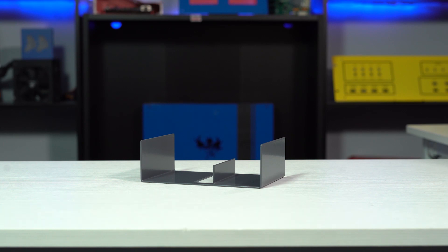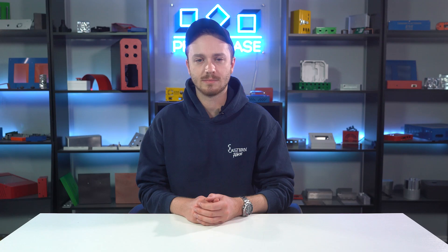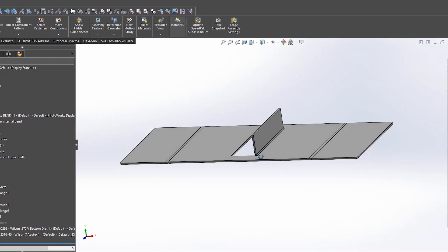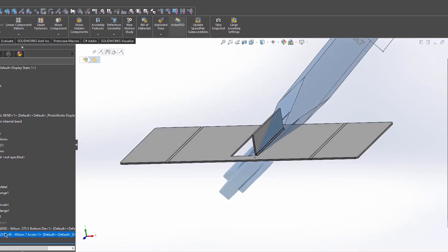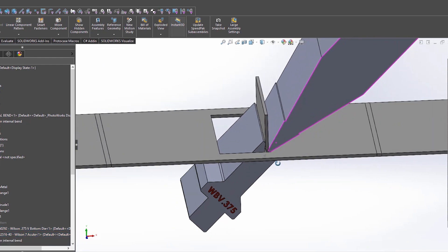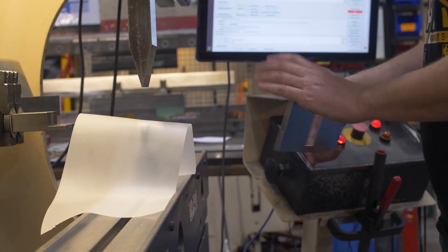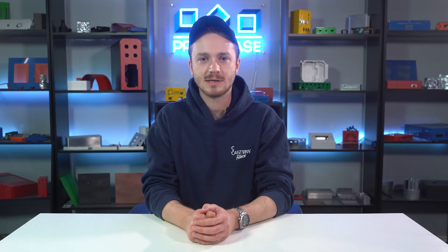Up next, internal bends. An internal bend is a bend that is placed on a particular area of a part where material surrounds the bend, rather than a conventional bend that is placed at the outermost edge of a part. An inset bend is very similar to an internal bend, except an inset bend is inset a small amount from the edge of a part, instead of being completely inside of the profile. In order to create an internal bend, we align the tool with the internal flange inside your part. This requires the internal flange to be large enough to fit the bottom tooling that will be used. Contact your Protocase account manager to have your design assessed by your engineering design team — they can determine what size your internal bend can accommodate.